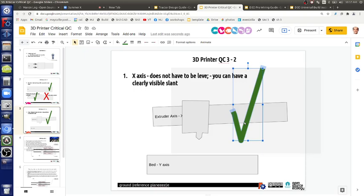Oh yeah. If you don't have a heat bed, the prints will not stick well. They won't stick to the PEI surface, which we saw this morning. It was not warm enough when they started printing, and it kind of stuck, and then it detached. Which was kind of cool to see in a way.